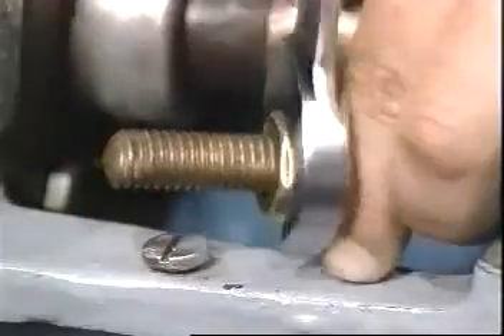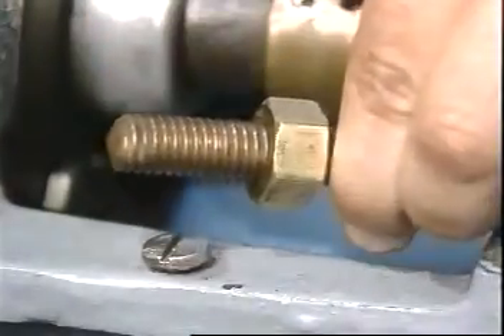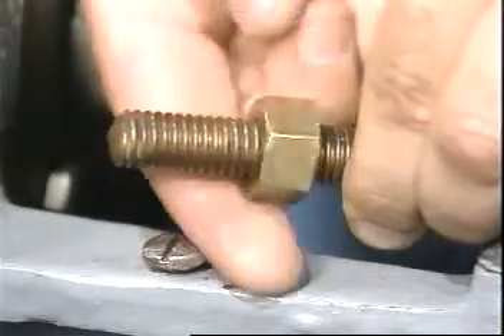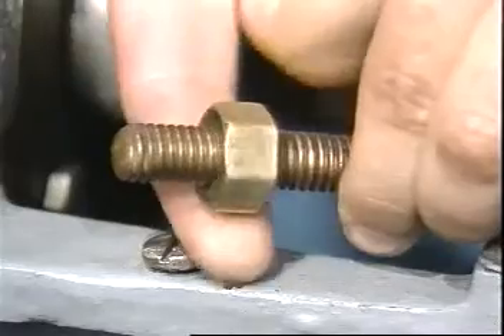Check the condition of the pump further by examining the gland bolts and nuts. The nuts should move freely and the bolts should be free of rust and corrosion. This will allow for correct and uniform adjustment of the new packing rings.